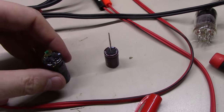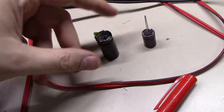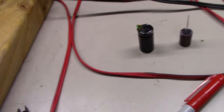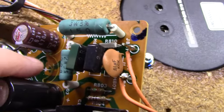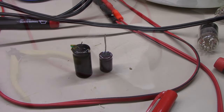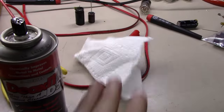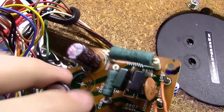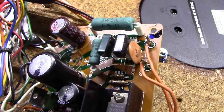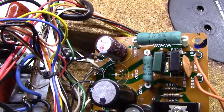On this next one you can see it's gotten a little wet where it's leaking out — getting my thumb slightly wet with the electrolytic fluid. You can actually see it on the board where it had started leaking out and etching away — it's kind of white underneath right along in there. We're going to replace it with the modern smaller equivalent. I also used a little bit of Deoxit and a paper towel to clean this board off, because I don't want that chemical to continue eating away at the board — that stuff is a little caustic.